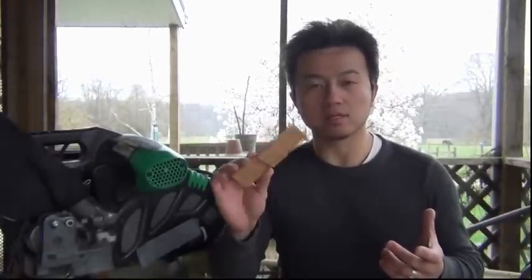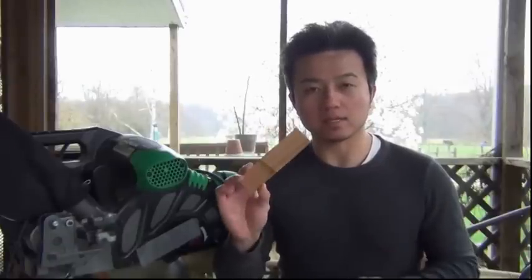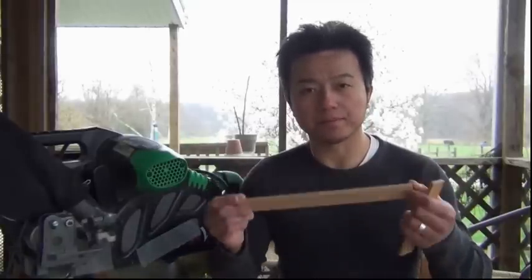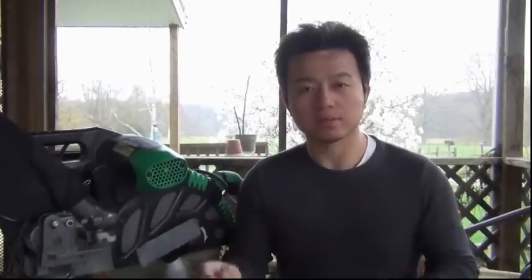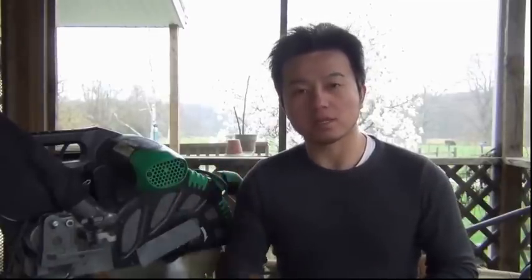To help us meet the challenge, I'm going to show you how to make this dovetail template. It is nearly identical to the one used by Paul Sellers, but to make this requires none of Paul Sellers' hand sawing skills. My template is made from two pieces of quarter-inch thick oak and three cuts on the miter saw.